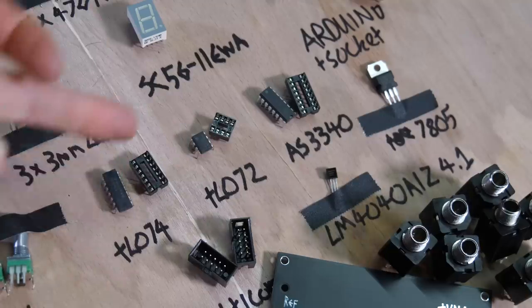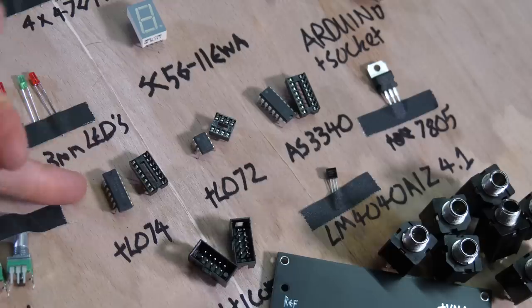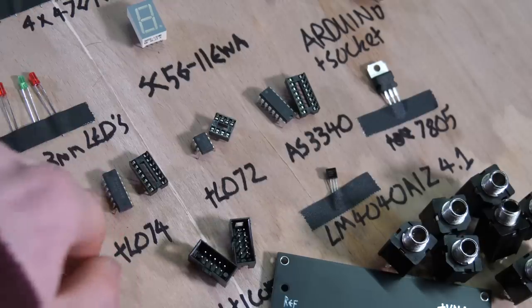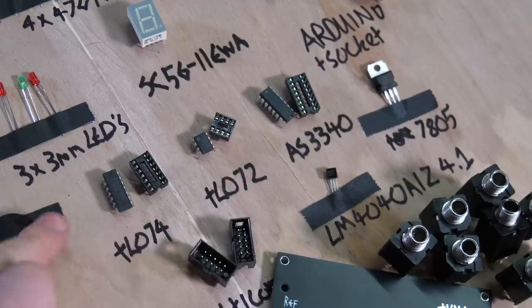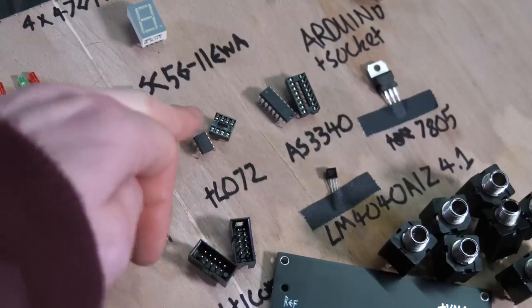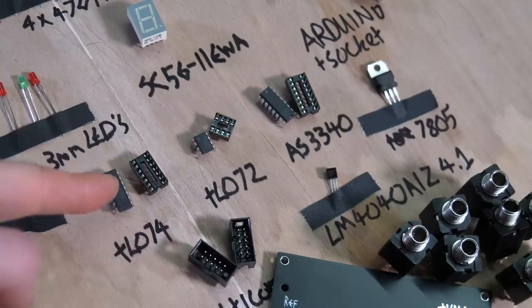Basically, you just choose how many and what kind of layout of op amp package you have, compared to how many op amps you have. So if this design had 8 op amps, for instance, you'd just have 2 of these. If it only had 1 op amp, there's a TL071, which looks the same, but it's just 1 op amp instead of 2 or 4.